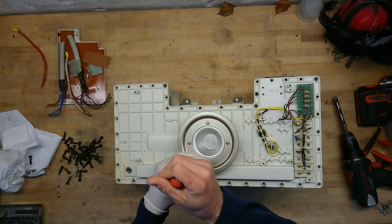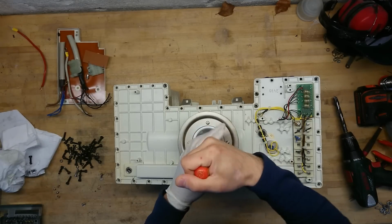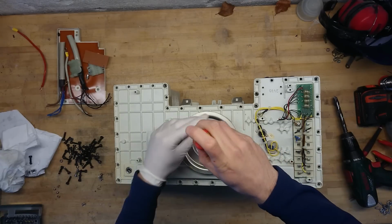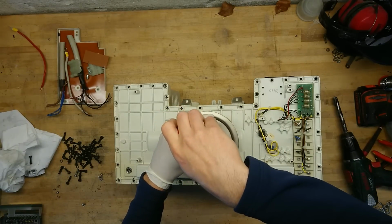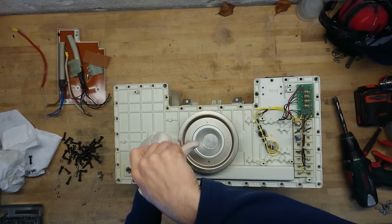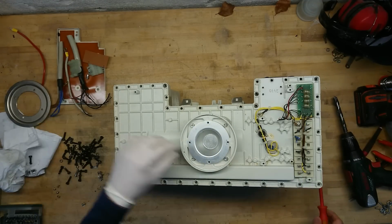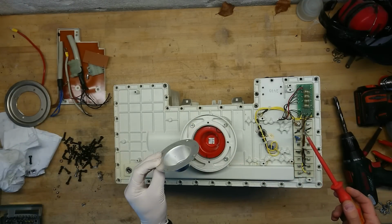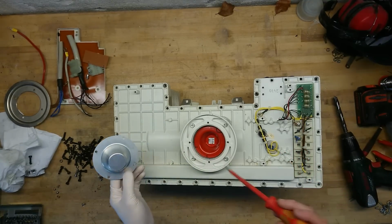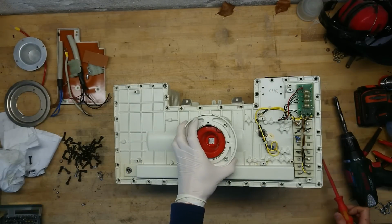We might as well just remove this little aluminium shielding in front of the output port of the X-ray tube. Now this is what is called the inherent filtering of the X-ray head itself. It was stated that it had 1 millimeter, or was it 1.5 millimeter of inherent shielding, and that's the little plate that we see here. See, that's probably one millimeter. Oh, maybe this is. Yeah, we can see down here it says 1.5 mm AL. So actually that is further down.